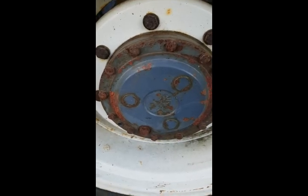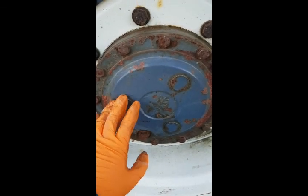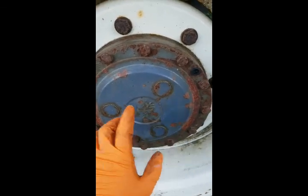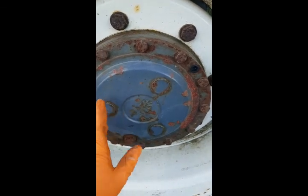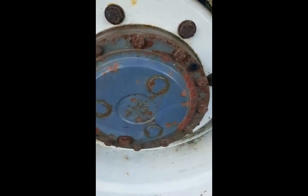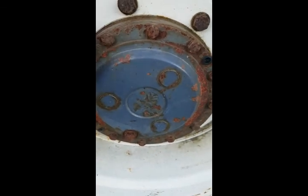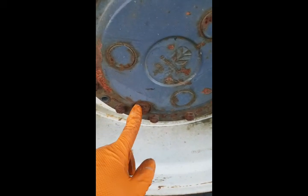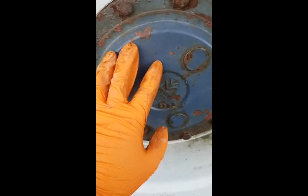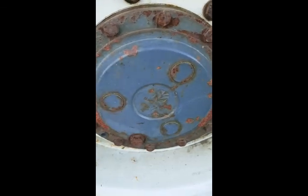Now this is a tractor axle hub, and it's much the same. Planetary gears in there, you can see different pins for three different gears. You have a gear in the middle, the half shaft, gears there, and a ring gear in there. That reduces the speed and puts more stress on these and less stress on the diff and internal parts. But see, there's a plug there. On these, only one plug, and you might find on a telehandler or loading shovel only one plug on them.